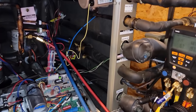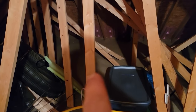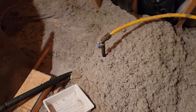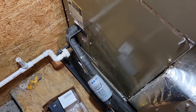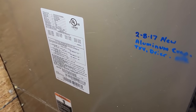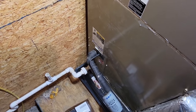We come over to the air handler up here in the attic. You can see the line set comes down through here, goes under the insulation, over into that dark back corner, and straight down to the basement. This is a two-story house, fairly large. He mentioned he removed the condensate trap because it broke and was leaking, so that needs replaced. The filter dryer is getting changed. I put a new aluminum coil in it in 2017. You can see that the sulfur gas in the air is affecting stuff even up here in the attic — it's pretty potent.